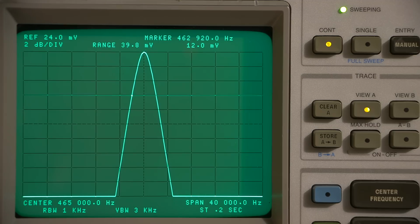So that's going to allow us to really narrow in on frequencies that have other frequencies very close to them. So we can really just get rid of all of the adjacent frequency noise. So it's pretty decent, not too bad. And that's at 6 down. Usually I measure them at 3 down, right? Because 6 is actually being kind of generous. They were always kind of generous doing that. But we'll just stick with the 6 because that's usually where these companies measured them. Okay, so 4.16 kilohertz wide in the narrowest position.